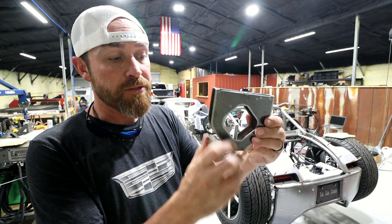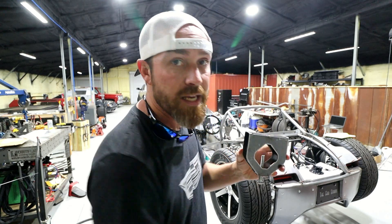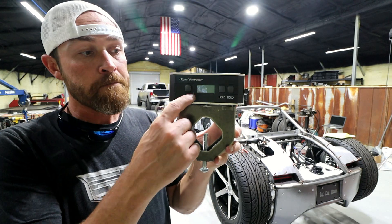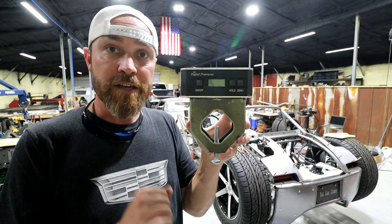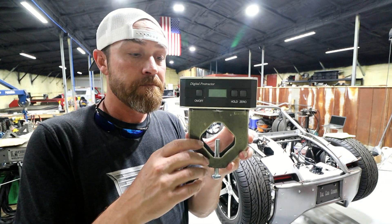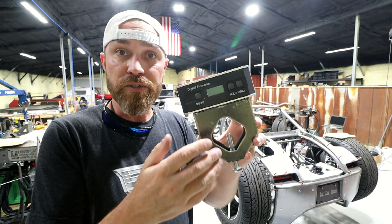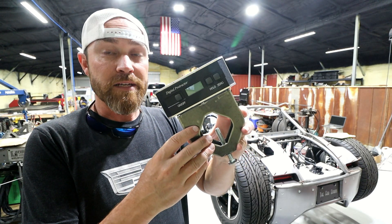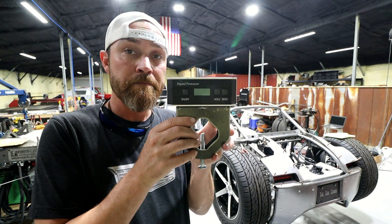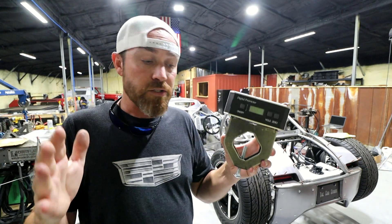Basically you just slide your tubing through here, you tighten up this nut, you can cinch it down pretty good, and then you'll take a digital protractor with a magnetic base, stick it on there, set it to zero, make your first bend, then run that tubing through to the next point of bend and rotate it however many degrees your software says or whatever you decide. Make your second bend, and then on the other side to match it, you'll do the same thing — make your first bend, rotate it however many degrees you need to, make your second bend, and the two are exactly the same.